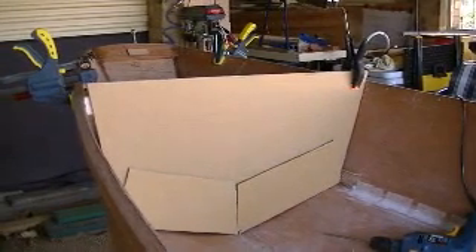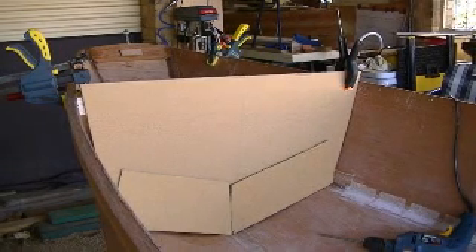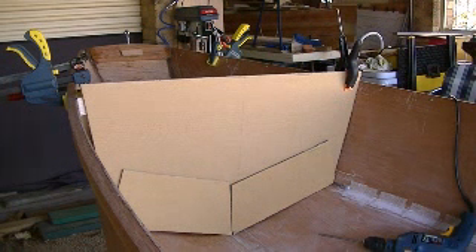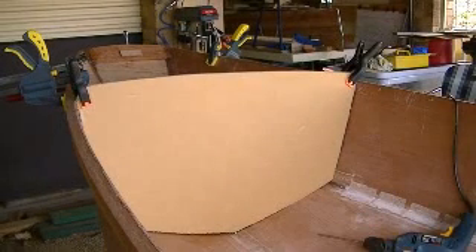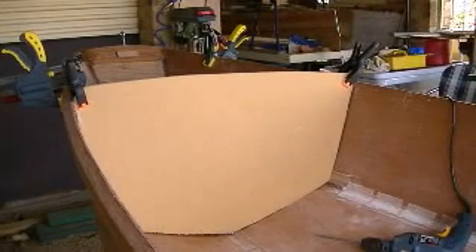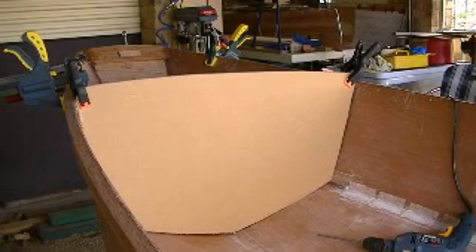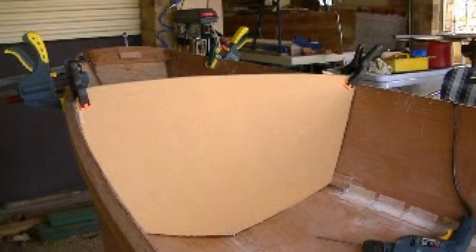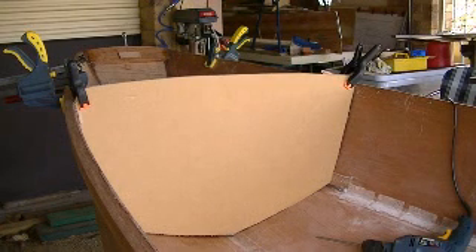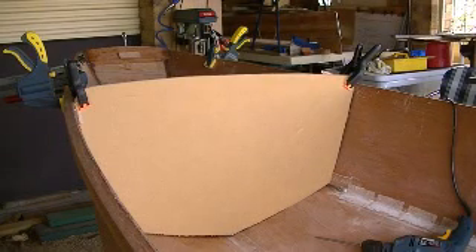After fitting that other small piece in the bottom, it's now made up of three pieces that will be able to be transferred onto a sheet of plywood and cut to shape. We now have a cardboard template in one piece, made up from four or five small pieces, to take the shape of the boat. This can be duplicated throughout the boat for any other section that is a watertight compartment or requires a bulkhead, and I believe it's the simplest way of doing it.